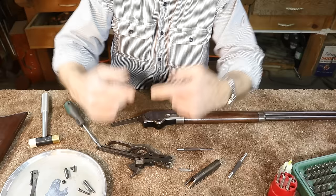Not too bad — or I say that and then it doesn't want to come the rest of the way. But we can pull our extractor out. We've got a screw holding in the back of the firing pin. When we get this firing pin out you'll see it's kind of a unique design — there's a leaf spring that rides underneath and spring-loads the firing pin retractor. This firing pin has a big bow in it up here, and that's so the toggle link can get clearance — the toggle link rides up underneath it. You'd think those firing pins would break pretty regularly, but I've had several of these Burgess apart and I haven't come across a broken firing pin yet.